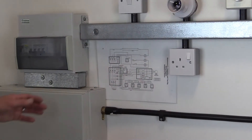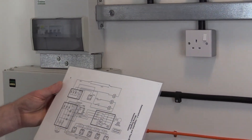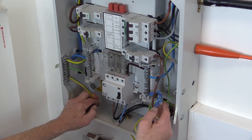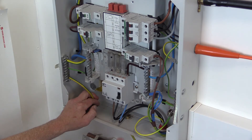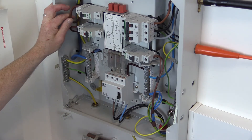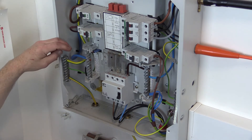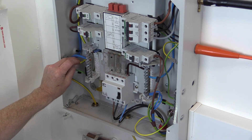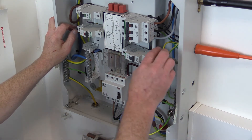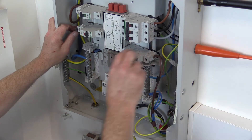A schematic diagram for test rig 2 is available, identifying the final circuits, but inspection will have to be carried out to determine conductor sizes, method of protection, and information to identify the devices for protection. This would normally be included with installation layout drawings, circuit charts, and cable schedules. This is of particular importance to the inspector, who will be comparing subsequent test results against various criteria contained within BS 7671 to establish compliance with the design.